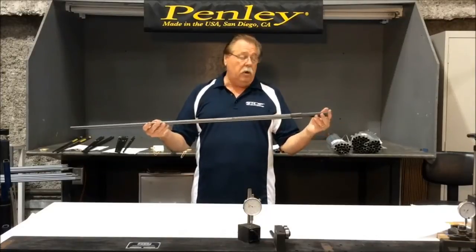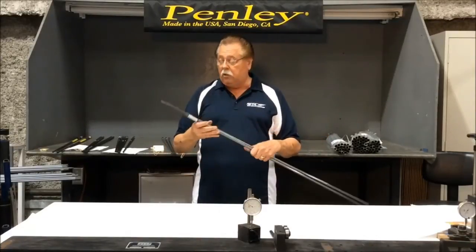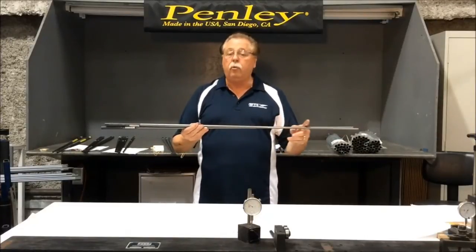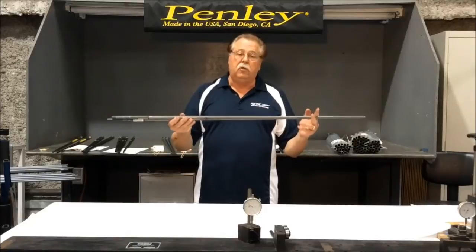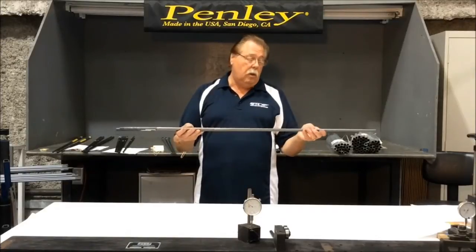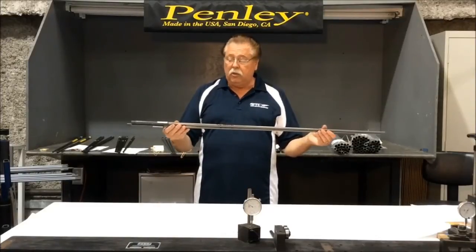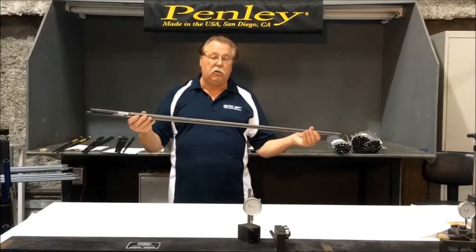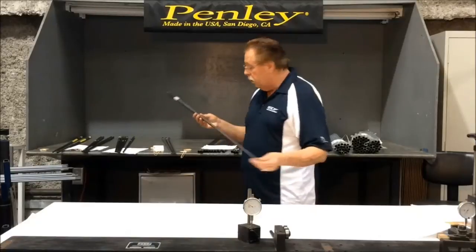So butt diameter again wrong. They tried to move it around the mandrel, I guess using one mandrel they found or something they had. I doubt that the included angle throughout the shaft is the same, so then its bendability or the actual load plane changes too. So it doesn't play at all like it should. Again, in these 12 shafts they actually sent me, none were in spec.